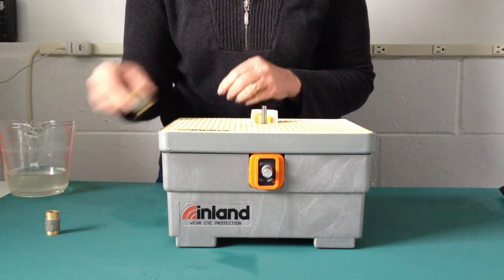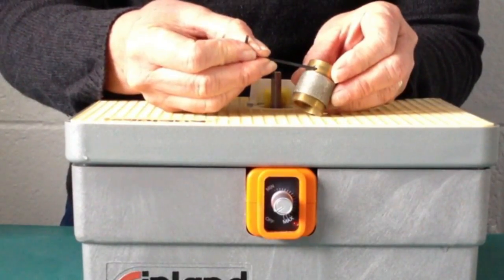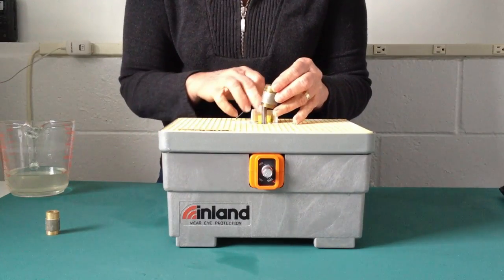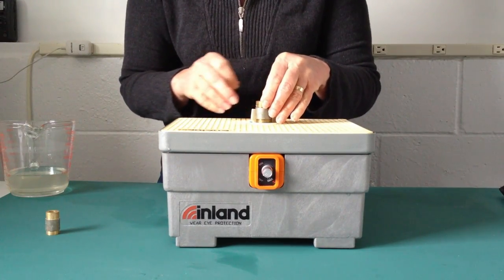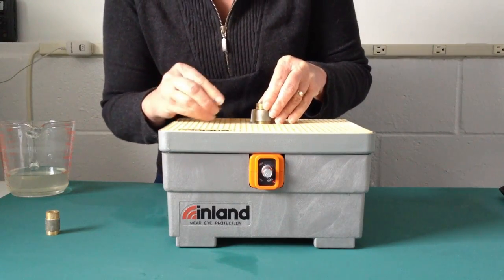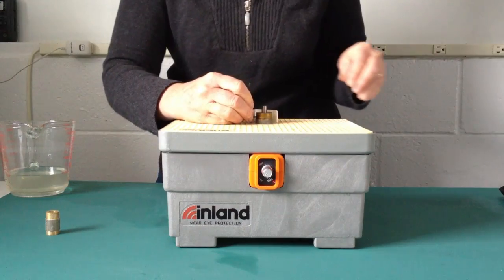When installing the diamond head on the machine, the set screw must line up with the flat side of the motor shaft. Place the bit down over the shaft. Loosen the set screw if necessary so that it drops all the way down.